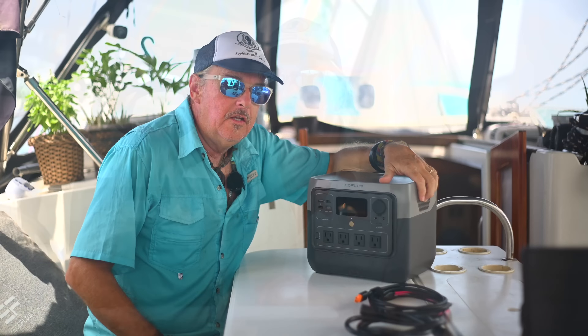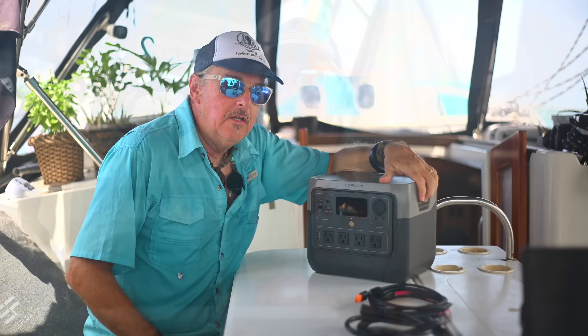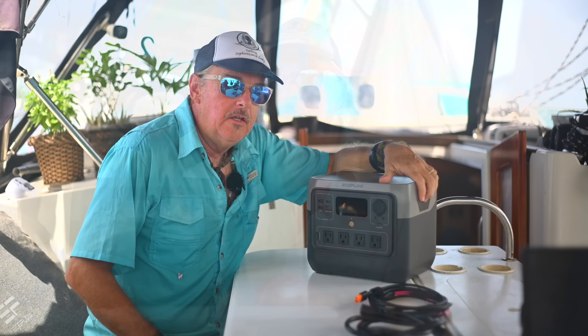This is a brand new panel and it is bifacial, meaning it has solar panels on both sides of it. I just brought it in from outside so it might be a little wet, but you can see it has solar panels on this side and on this side. This is the primary 220 watt side, but the back side - if you put this up against a reflective background, white or light colored surface, or beach sand - it will actually increase the output of the solar panel and you'll collect more energy faster. This one panel is expected to recharge this station from zero to 100 percent in just under four hours in full sunlight.